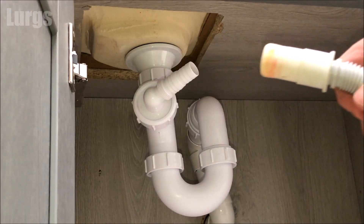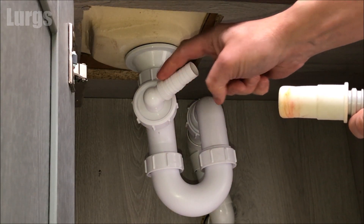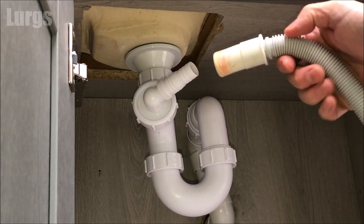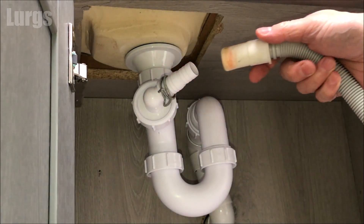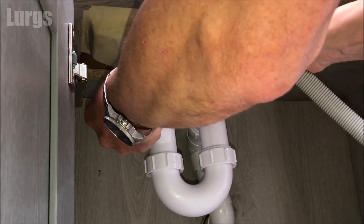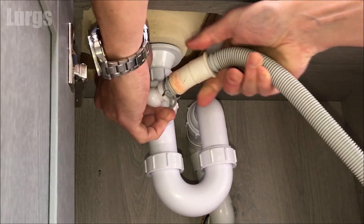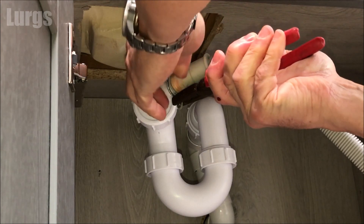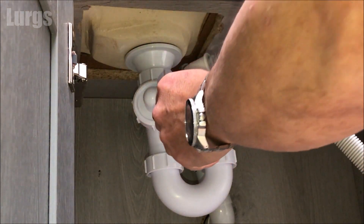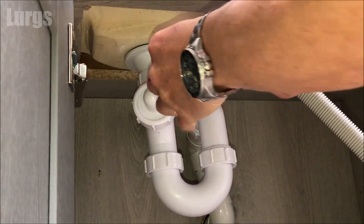If you've got one of these U-clips, push it into that — it stops any blockages or smells. The other type you might have is a U-bend underneath your sink with one of these attachments. Put your drainage hose onto one of these. If it's a really good tight fit you can just squeeze it all the way on, but I recommend you put some kind of clip over the top just to keep it in place. I've got this metal spring clip — squeeze it with the pliers and put that spring clip onto the drainage hose. That is the washing machine drainage hose now connected to the U-bend underneath the sink.